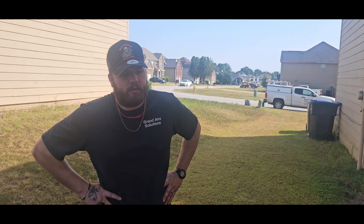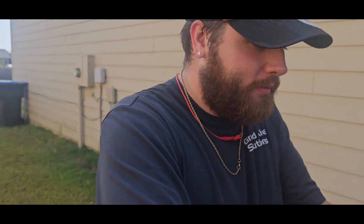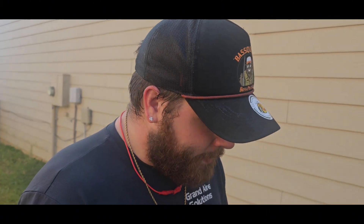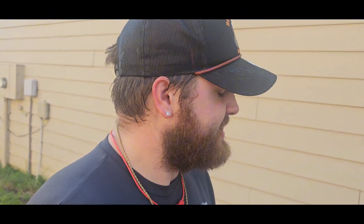The people ain't seen you in a minute buddy — you got any life updates? Let me get away from the vacuum pump cause it's loud. My baby is 11 months old today — got four sets of teeth, saying 'dad' like it's nothing. Been busting my butt trying to be better at this, working weekends. You found this evaporator coil bad — did you put the dye in? Yeah. How long did it last? About two weeks. How much refrigerant did you have to add? About three and a half pounds. It wasn't that low but it was low enough to affect cooling — it wasn't freezing up, just wasn't cooling.